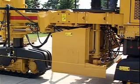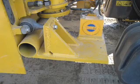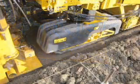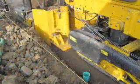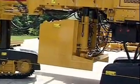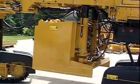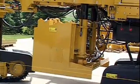The trailing pan on this mold features three pan vibrators for the initial compaction of the base material. The first pass of the machine provides the grade for the slip form operation and helps maximize the utilization of concrete material. Two heavy-duty hydraulic cylinders provide vertical adjustment to this mold for setting the grade depth below the track line and raising the mold for the paving pass.